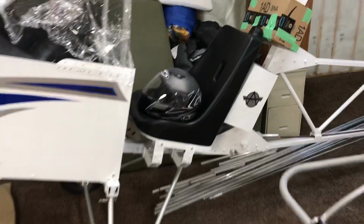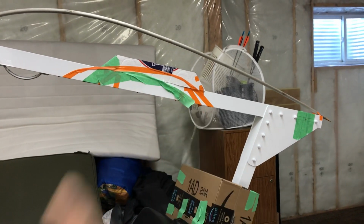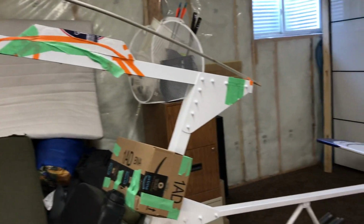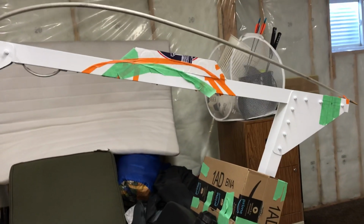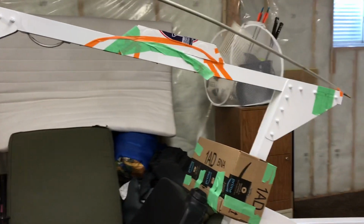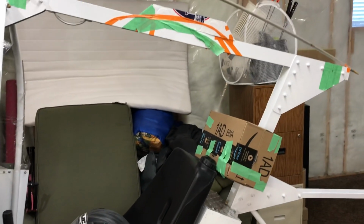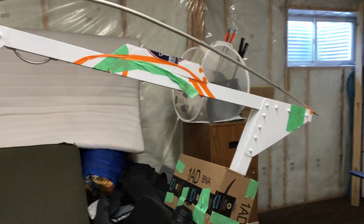Bigger tragedy. I neglected to give myself enough headroom when I sit in this thing with my helmet. When I sit in there, I don't have very much clearance at all for my helmet to fit up here. So, big problem. I'm disappointed in myself for missing this. It was easy in the build stages to lengthen these longerons right here and push this up a couple inches. It would have been easy to do, but now it's a big retro surgery we have to do. So my dad, the engineer, is helping me work that out. We're going to have to raise it, with gusset plates and bolts again. But I need to do it because I need to wear the helmet, and it's just no good if I don't. So there we go.